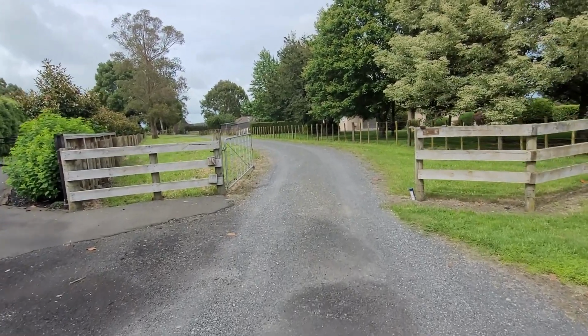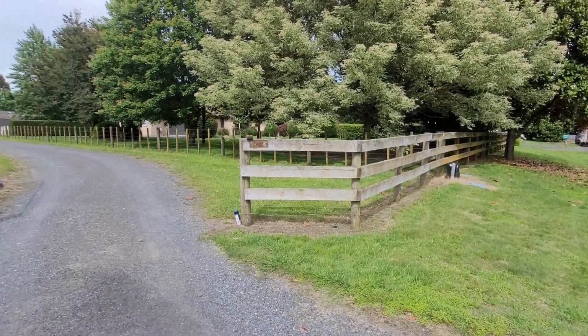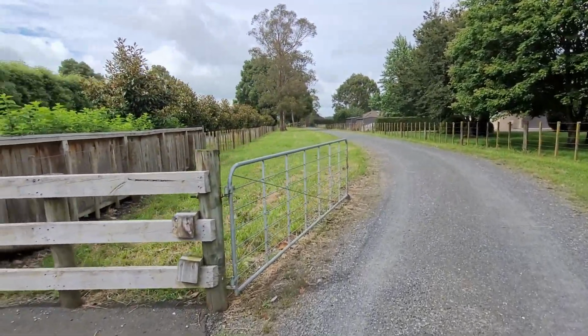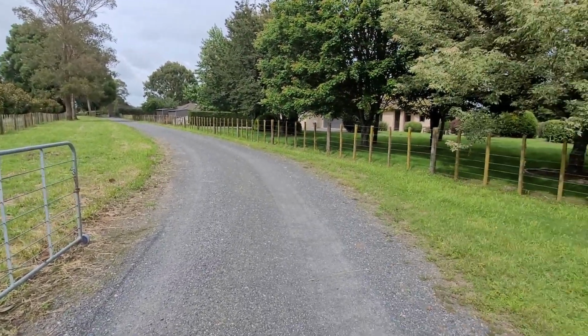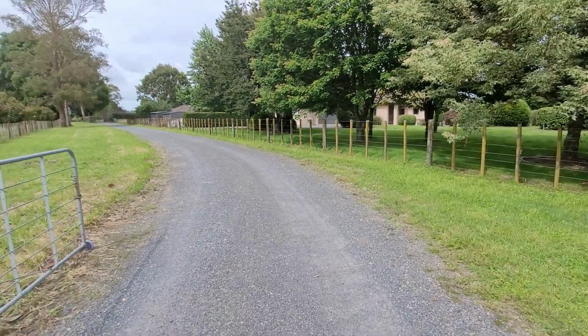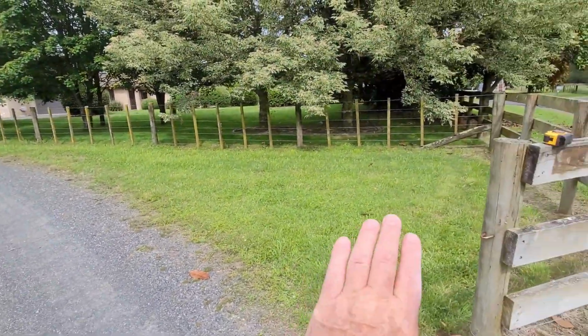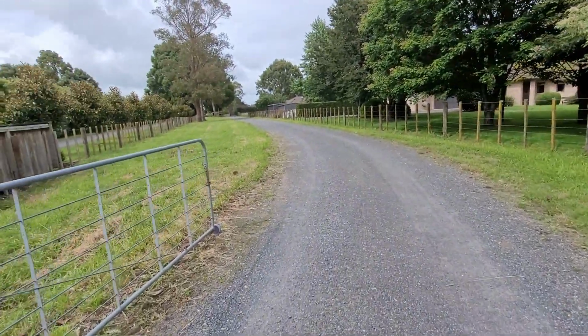What I'm going to do is pull this fence out that we got across the front, and we're going to build a blockwork wall halfway down that fence there and across, with electric gates in the middle. The reason we're offsetting it a bit is because I want a post about here somewhere so you can push a button when you drive in.